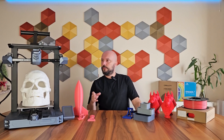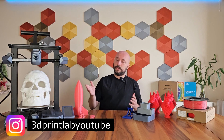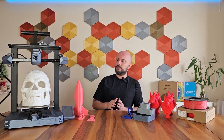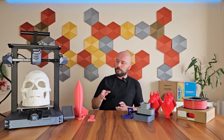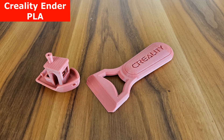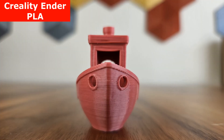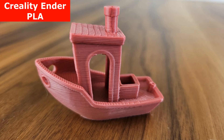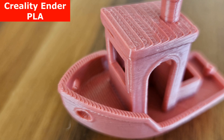The general features of the printer are like this. The CR-10 SE has different features compared to the previous CR models, and let's see what kind of impact these new features had on the printing results. I've used the printer extensively, working with many materials like PLA, ABS, PETG and flexible filament TPU. Let's start reviewing with the PLA printings. The first two were ready-made G-code files that came with the printer — the classic Benchy Boat and a spatula. The Benchy printed quite quickly in 20 minutes. At standard speeds this printing time can be around 1 hour to 1 hour and 20 minutes. I used Creality Ender PLA — not a type made for speed — however, the result turned out quite nice. There is no sagging, no stringing and no layer errors on the model.